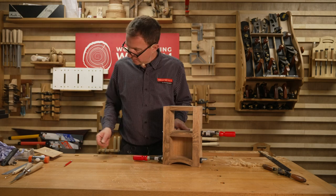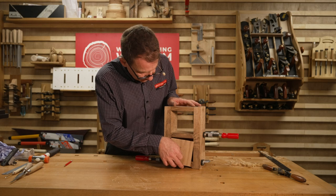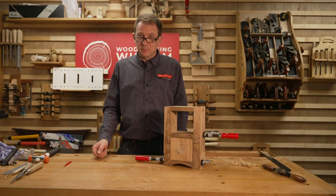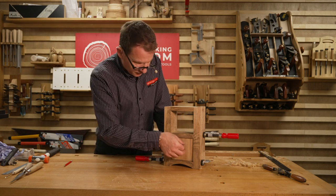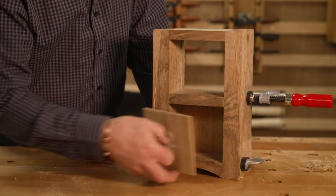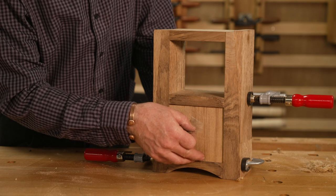We've got our panel in. We now need to do, and I've done one, got two of these to do, a little inset door that will go into here, lift up, drop back down. This is the back. So this will have something as a pull, but this allows us access into the back. So that's why the grooves were slightly different depths, so we can go up and back down.